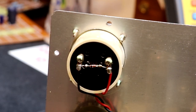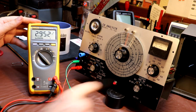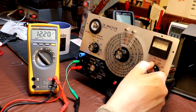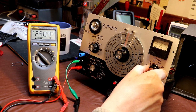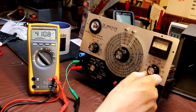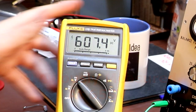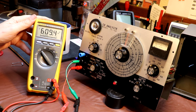Having replaced the batteries in my Fluke voltmeter, I decided to go back and recheck the voltage measurements for the voltage selector switch, because they were reading higher than I'd have liked. The three-volt setting is now reading 2.9V. 6V is bang on. 12V is 12.2 volts. 25V is correct. 50V over by a little. 150V is 5 volts over. 250V about 8 volts over. 300V nine volts over. 350V ten volts over. 400V ten volts over. 450V eight volts over. And the 600V range is just 7 volts over. As I stupidly just demonstrated, flat batteries in your voltmeter can make quite a big difference to your readings — a bit of a noob error, but I've shown you the mistake so you can avoid it.